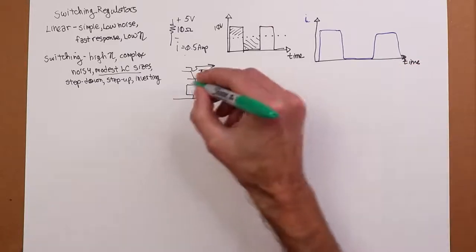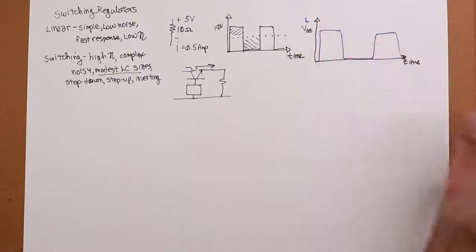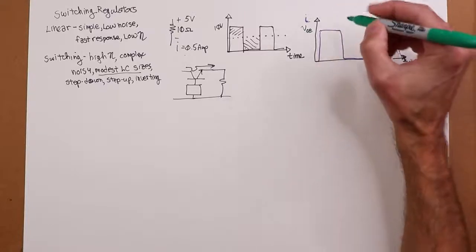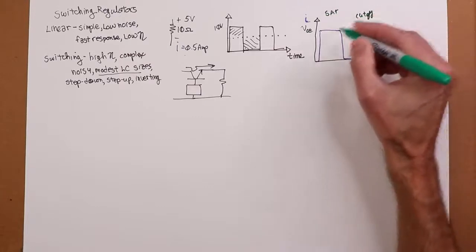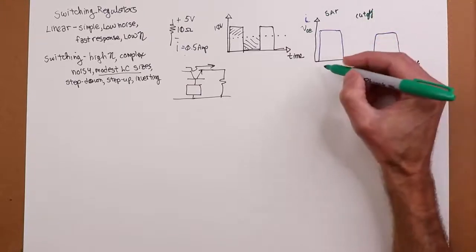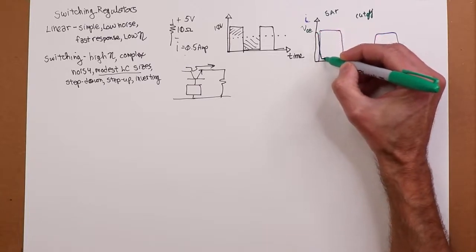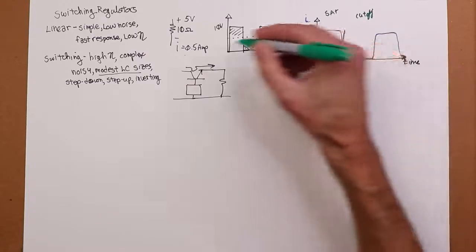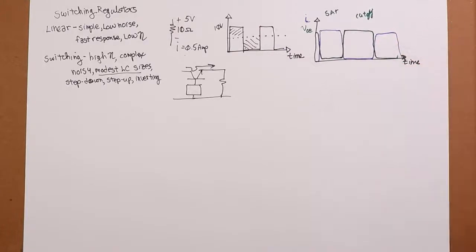Now, the voltage across the transistor, the VCE, is going to flip this, right? So this is saturation, over here is cutoff. Well, the saturation voltage is really small, maybe a few tenths of a volt. So we get something like down here. And then when it goes to cutoff, this thing pops back up to, let's say, 10 volts. And the same thing happens and it just repeats.